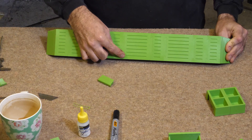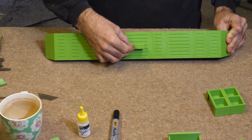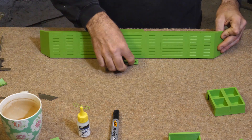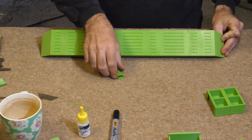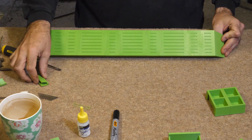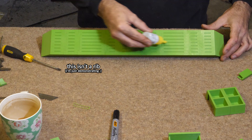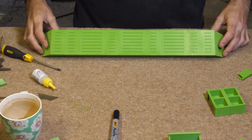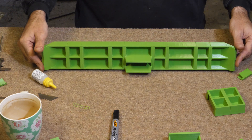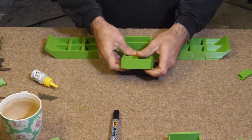I've also added more grooves to the bases of the modules — that's the sand side. A few of you wanted positive ribs on the inside, which would be cool, but it would mean the 3D printing would be much more difficult as the whole module would have to be floating on a raft of support material. I'm really trying to avoid supports as they're fiddly and clean-up can be a nightmare. But the good news is I've made the indented slots a nice triangular shape, so after printing you could totally glue in some extra 3D printed ribs. The slots would serve as a lovely gluing surface of a known dimension.